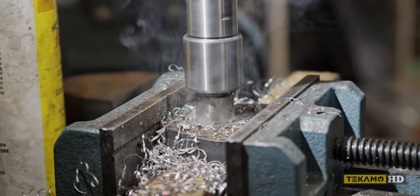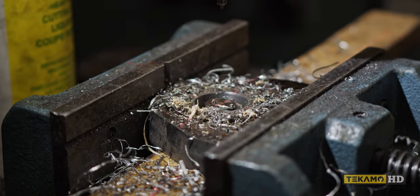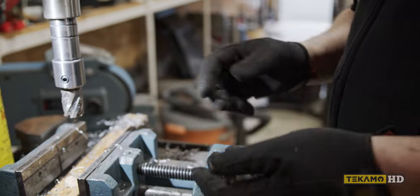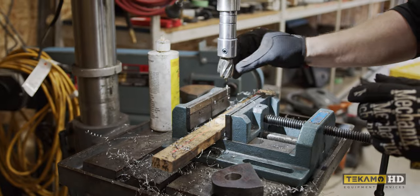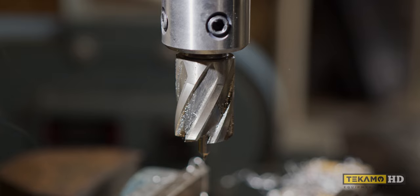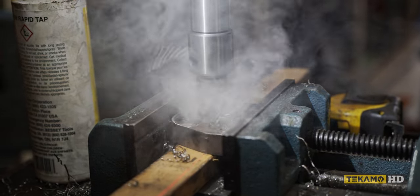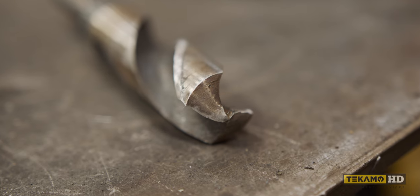So this just went through. When I remove this you'll see there's a slug in the center — there's a hole there. It doesn't drill the entire hole out; it actually leaves a slug in the middle. So it's technically taking away less material, which lets it work more efficiently. It also has six cutting flutes on it as opposed to the two that a regular drill bit has, so each cutting surface is working less to remove that material.